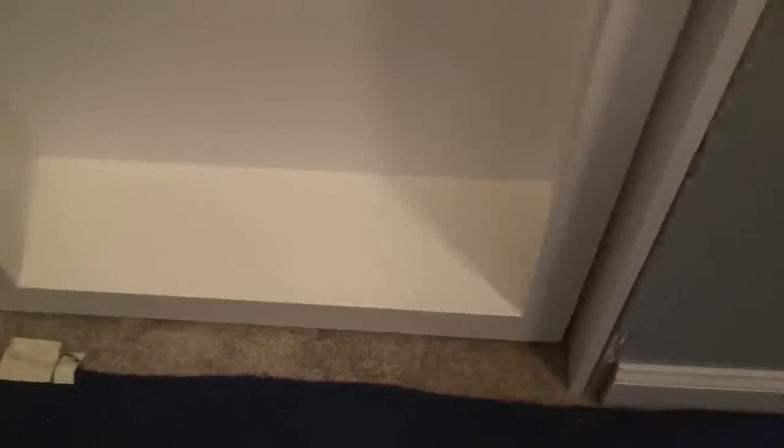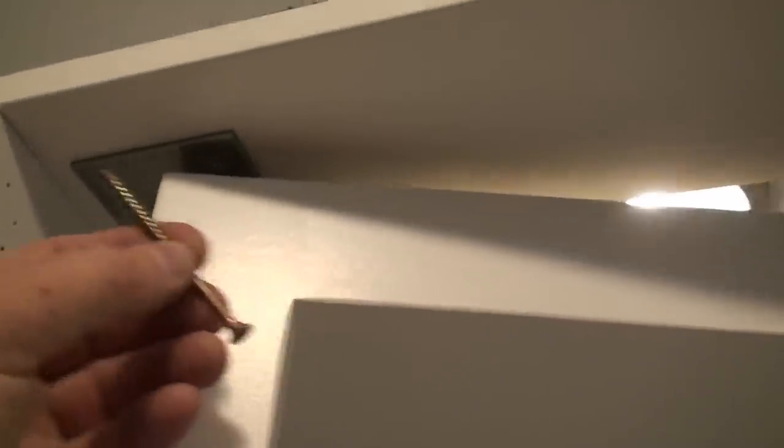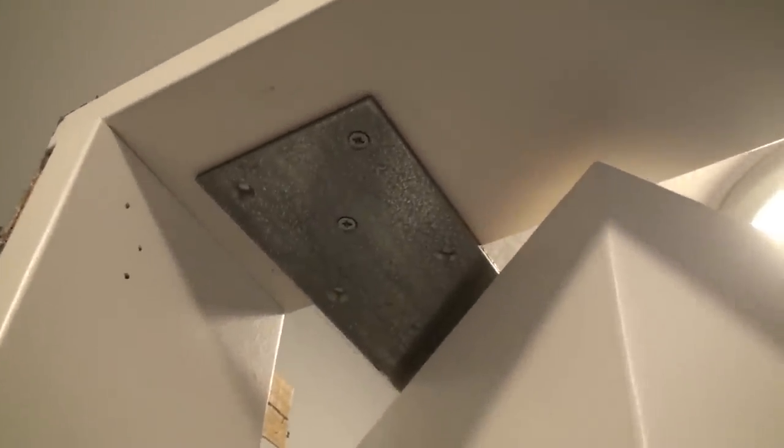This door's coming out very nice. I just had to shim a little bit on the left side. I added some washers on the bottom just to bring it up. This piece of trim just has to be within three-quarters because that's going to be my door stop. I added some half-inch washers to the bottom as opposed to shimming it down, because at the bottom I'm going to add a floor sweep. Just barely clearing there as we close the door — give yourself an eighth of an inch or so; don't make it too tight. Now I'm going to take some three-inch screws and go ahead and lag that top plate in permanent.